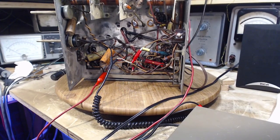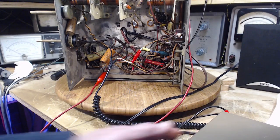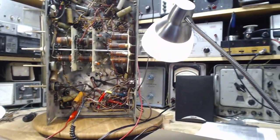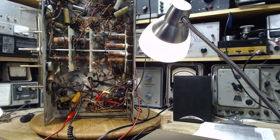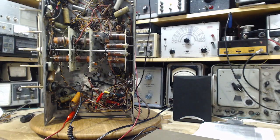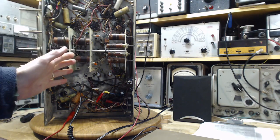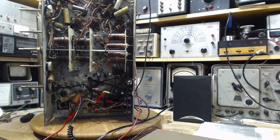I've studied the schematic and I'm reassured this is the right spot for B+. I can control the output voltage and the supply has a current meter, so I can see the drain. One reason for doing this is to find out if there's a short in the high-voltage systems. I'd rather find that out with a power supply than by turning the radio on directly.